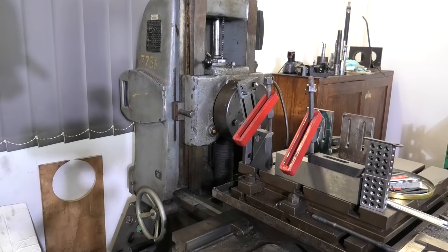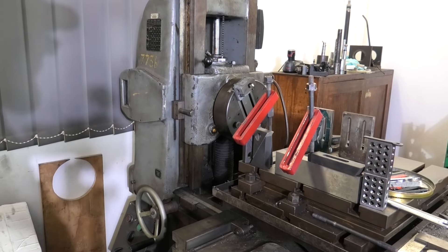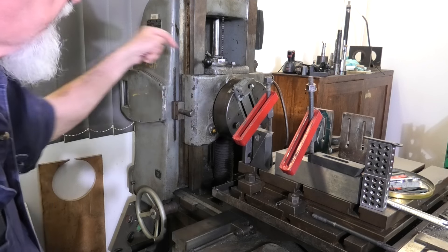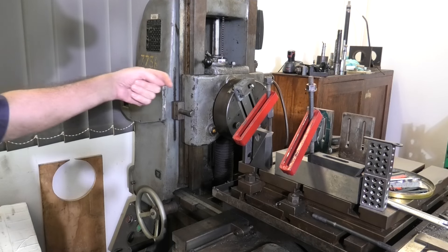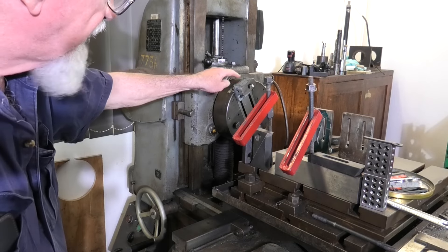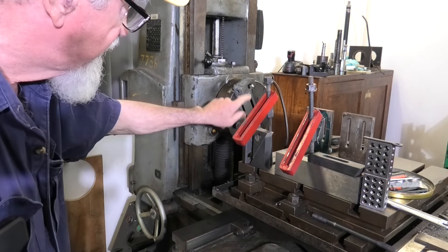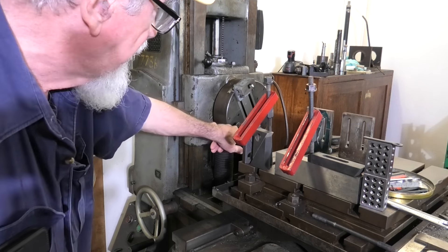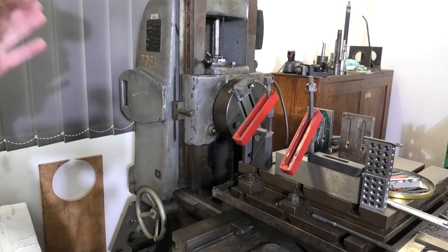I'll swing you up for a look at the head. On the top here is the high and low range selector — quite a big difference, about 3 to 1. I've got the facing head on it at the moment with the facing cutter. This slide here traverses across the facing head. There's a feed from the back — it draws a quill shaft. There's a small bevel gear inside here and a half-inch BSF bronze feed screw that runs the slide backwards and forwards. We have a little V piece that slides into the sliding piece when it's dead centred, making it easy to put the snap bar on in the right place. And we have a couple of clamping plates on the head so wherever you want to clamp the boring tool you can get a bit more rigidity.